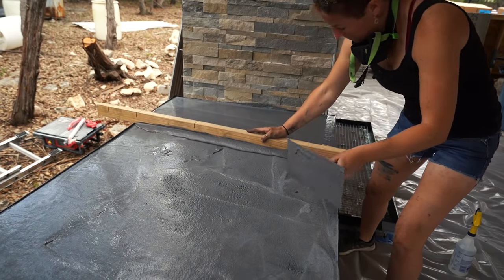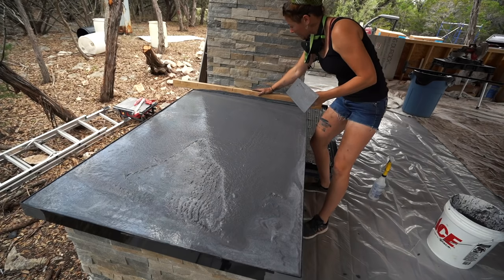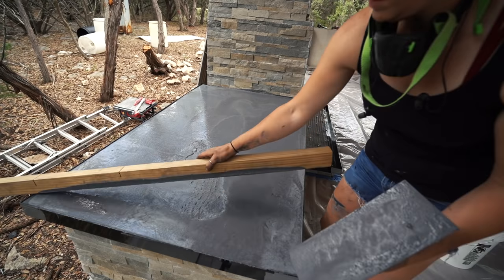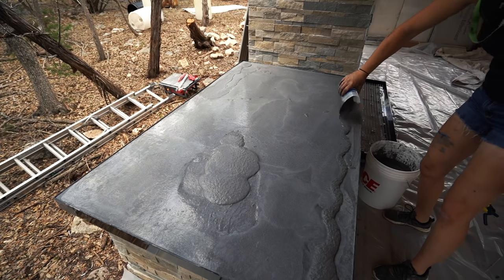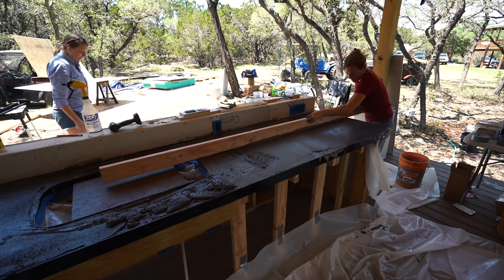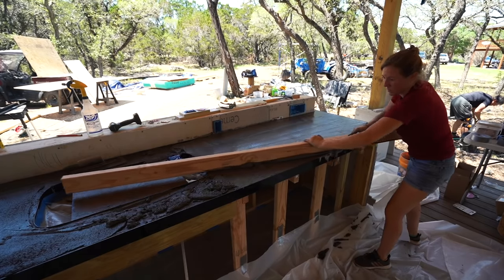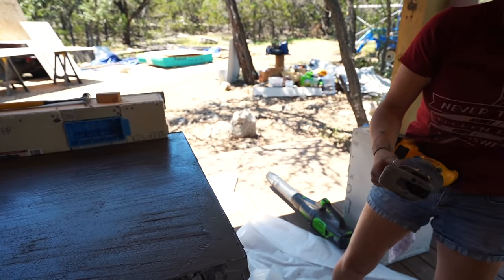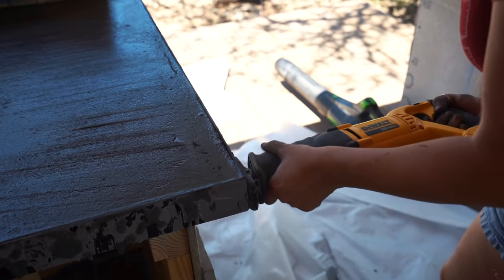You want to slightly overfill the form, then you use a straight edge to span from back to front to level it perfectly to the top of the forms. You can buy a screed but I always just use a straight edge from around the job site. You use a slight back-and-forth motion and move from one side of the form to the other. The screed picks up the high spots as you move and will also expose all the low spots. After I make a first pass I fill in the low spots then do it again, letting all of the excess just roll over the sides. The long countertop was pretty tricky — for this I would span from the sink form to the edge and this actually worked great. Jacob was finding all the low spots and throwing in more concrete to fill them in for my next pass. Then immediately after you get it level you need to go around the edges and vibrate it to get out the air bubbles. They make actual tools for this but I personally just grabbed a sawzall, took out the blade, and used it to hit all of the edges — this works great.